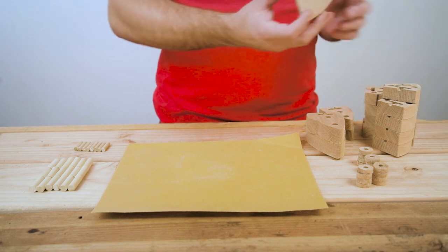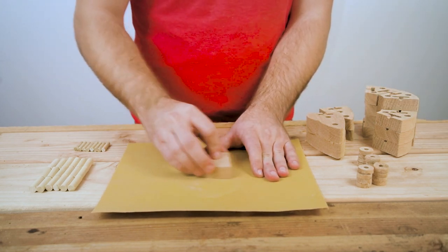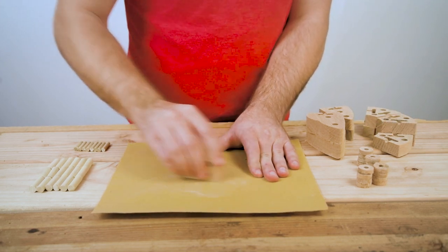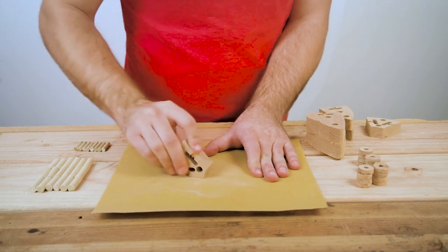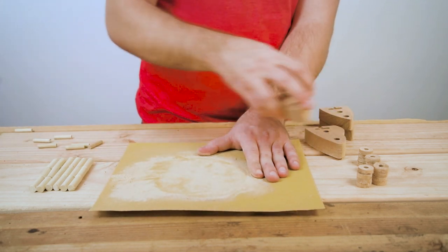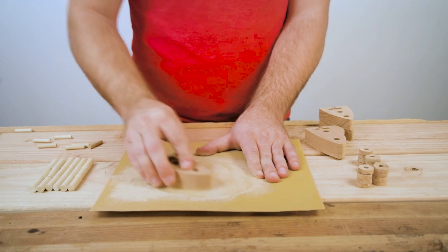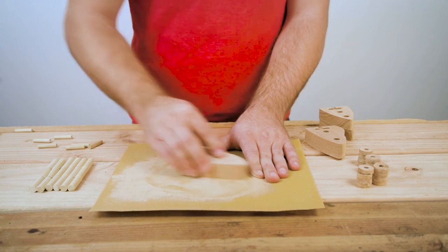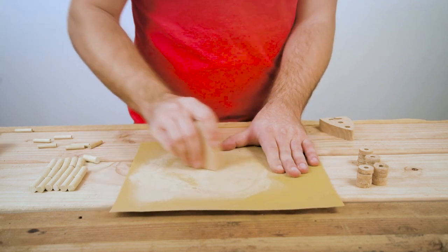I just took everything for a light sanding to clean up all the edges and faces. This is just a prototype so I grabbed a sheet of 120-grit — nothing too fancy — for a quick cleanup. I make sure to use the sandpaper on a relatively flat surface so I can use that as my reference plane when sanding, which makes quicker work of the larger faces.